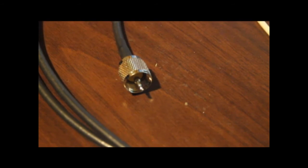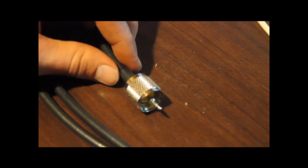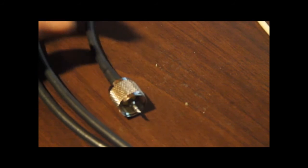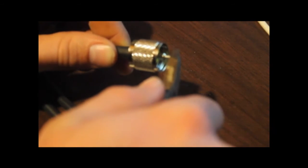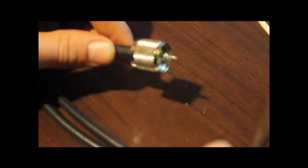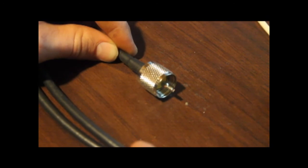That's nice and tight — pulling quite a bit and it's not going anywhere. The outer shield is now connected to the body. Bring the threaded nut back up, bring the shrink tubing up, slide it over so it's bridging the crimp collar and the actual coax. Melt that on with the lighter — you don't need to catch it on fire, just wick the flame over it. Then get the soldering gun out and solder that center conductor. Trim off the excess and the PL259 is done.